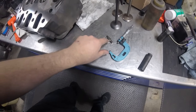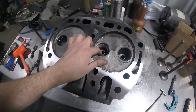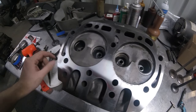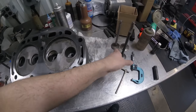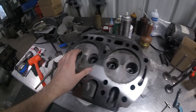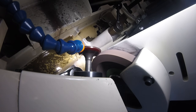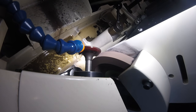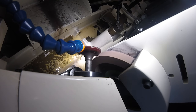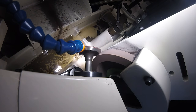I was using the snap telescope gauge with a micrometer to get an idea of the ID that we need, as well as looking at the valves and what's already here to pick out a good seat. Back on this exhaust valve, I put some color on the face to make it easier for the camera to see when I grind it. When I slow this down you can see the low spots in the valve face that hadn't cleaned up yet, but a bit more grinding and we have a new precisely machined valve face.